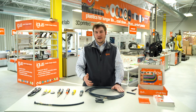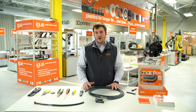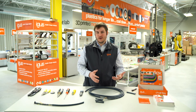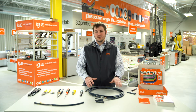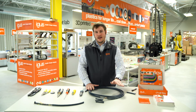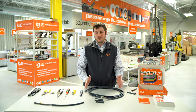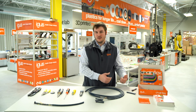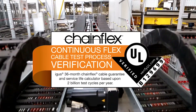Now that we've covered how to strip back a cable with hand tools, one other question we get is: why are IGUS cables a little harder to strip than most cables? The reason is usually the jacket material and the inside materials of the cable itself. IGUS chooses materials based on their use inside a cable carrier application, good for millions of cycles and backed by our cable guarantee.